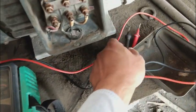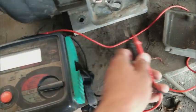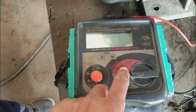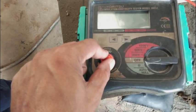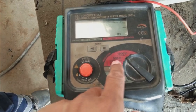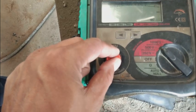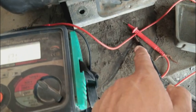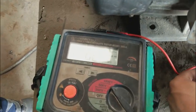The test procedure is easy. On this insulation resistance tester we will test it — there are two probes as you can see. For this particular test we will set up the insulation resistance tester to 500 volts. I am setting it up now. This lock switch is important — if we turn and press it to the lock position, it will be ready to test the motor. So now 500 volts is coming on the probes for testing.